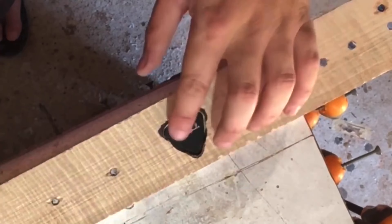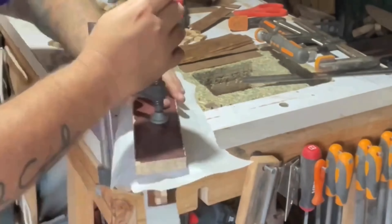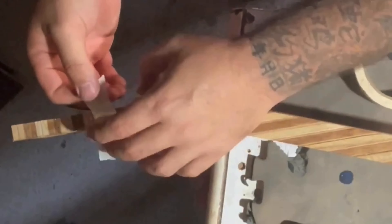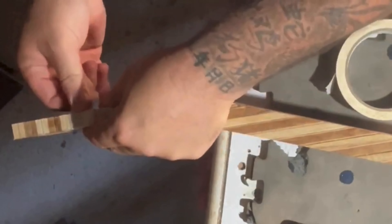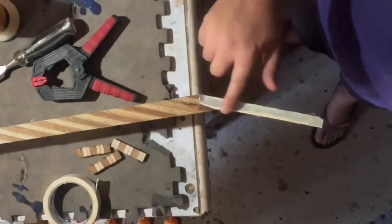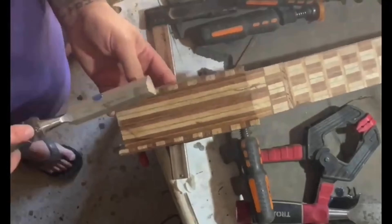The resin was actually from when I had the burl blank for the guitar. I thought I'd inlay a guitar pick at the 12th fret, so I painted around it with black stain, put a bit of shellac over the top, and stuck that in there. I went wacky with the end-grain ears just to make the laminations even more prominent in this neck than they already were.